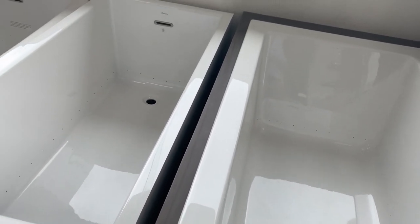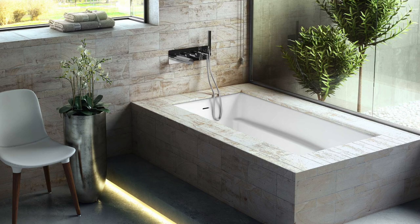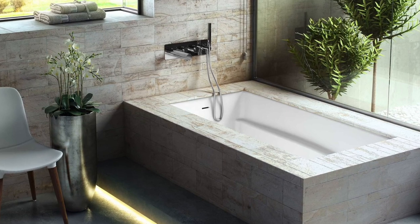As a side note, you can actually undermount a drop-in tub as long as it has a flat edge like some of these that I'm showing you today. The way they do that is they build up the plywood and take the tile or granite and go over the edge of the tub.